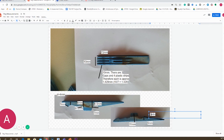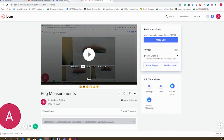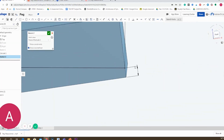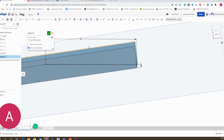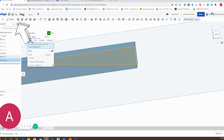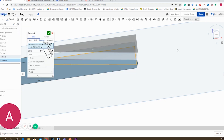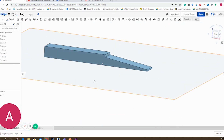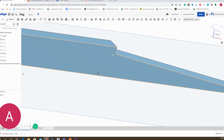I'll ensure the sketch is a complete shape that I can cut, which will allow me to cut away the material above. You can do this by selecting the corners, connecting to the line, then the top right-hand corner, and reconnecting to the bottom dot. That creates a shape I can select and extrude — making sure I'm removing rather than adding. And there's my first extrude.